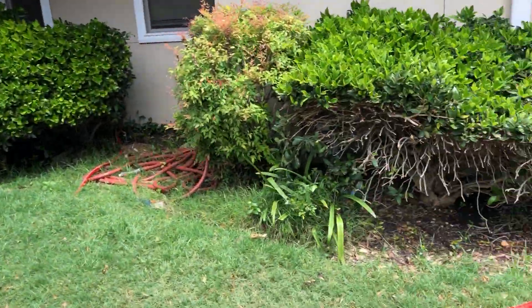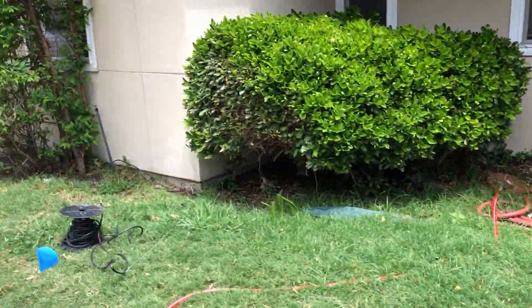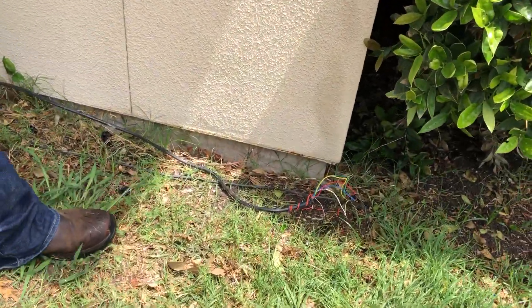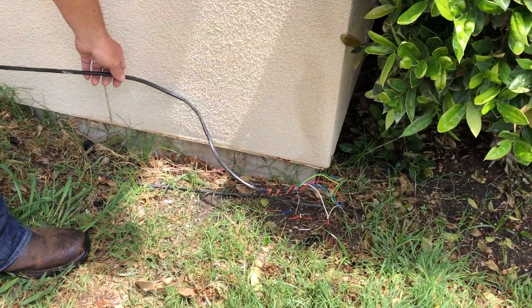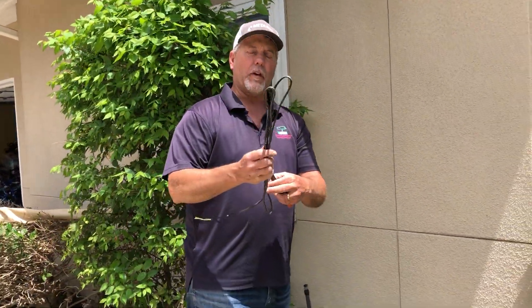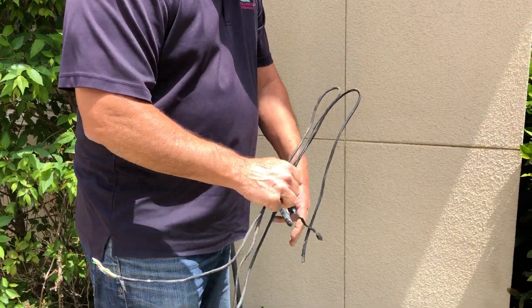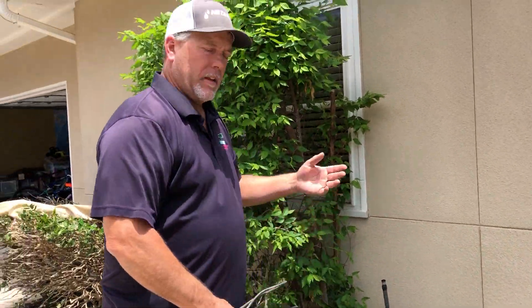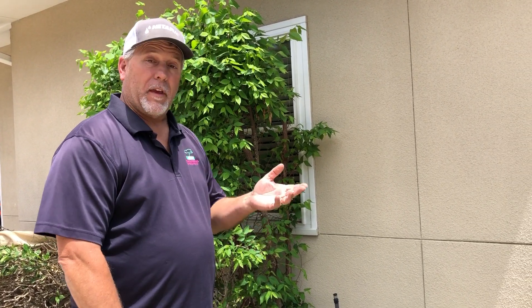He had dug out some plants in the flower bed, and we came into this area here where some shrubbery had been taken out as well. Currently we have it all spliced back together, but it had been hit by a shovel — and this is what we took out of it. We're splicing that back together and actually going to add a new controller that we'll run the wire to. Once we found the break in the wire where it had been hit by a shovel, everything began to work. So everything is in good shape now.